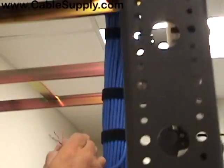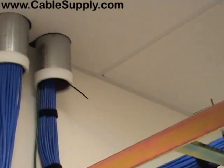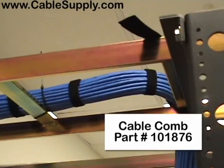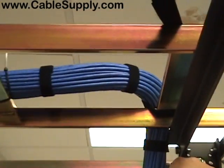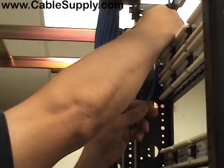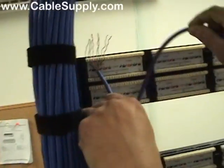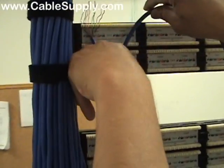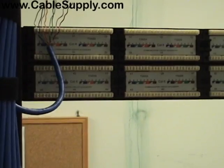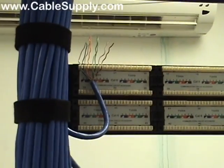What we've already done is taken the cable, cable combed it out — there's a video on that — and we've given gentle slopes all the way down to what's called the relay rack. The technician here is getting ready to do some punch downs; we'll just dress all of these in to the terminations.